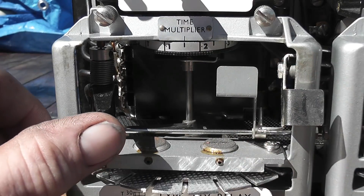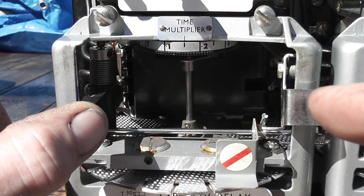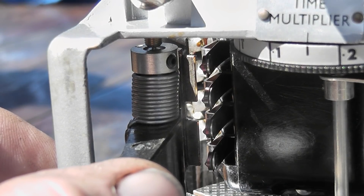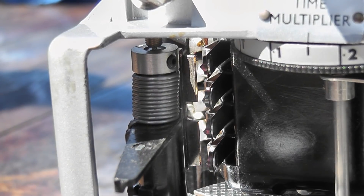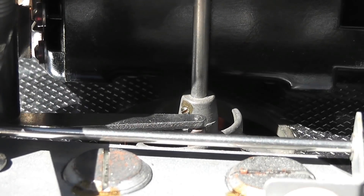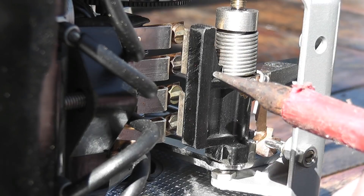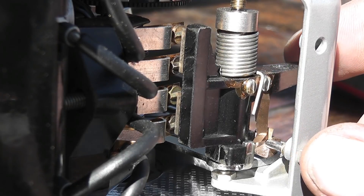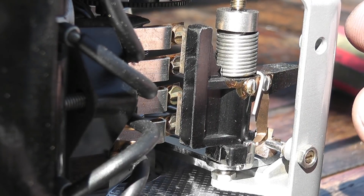I'll reset this again. This lever I'm touching with my hands is actually geared to the disc and will operate the contacts. There we have the device which operates the lever and the flag that has dropped out. As you can see there are two contact bridges — contacts one, two, three, four. There's a little brass or beryllium copper piece that will close these contacts together, and hence the operation of the device is achieved.